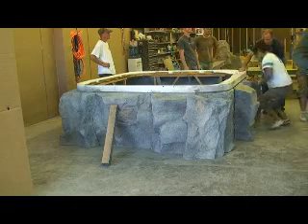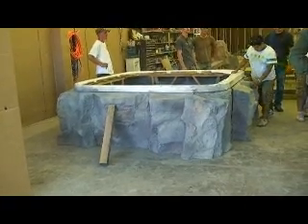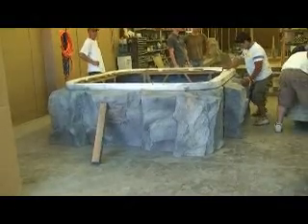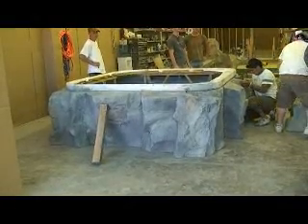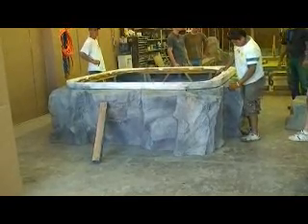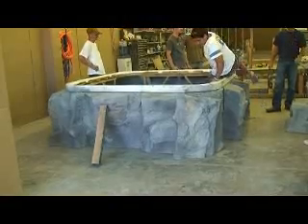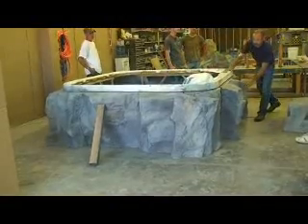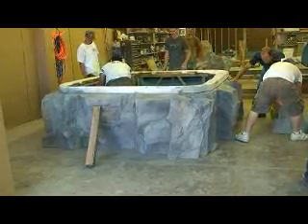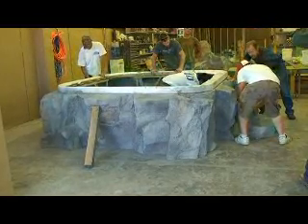As far as square footage, how much Stone Tough? Do you have that ratio? Two and a half quarts. Just figure two quarts for easy calculation. There are how many two-quart portions in a five-gallon bucket? Four quarts in a gallon — so it would be ten. Thirty divided by two is fifteen. You can do fifteen buckets with one bucket of Stone Tough.